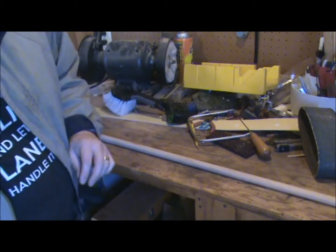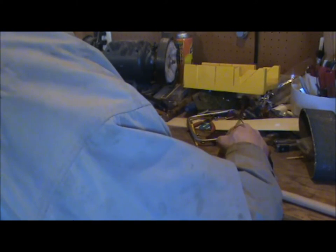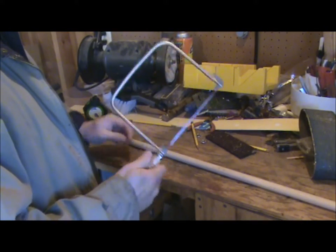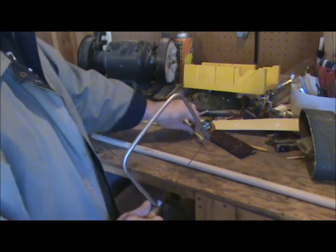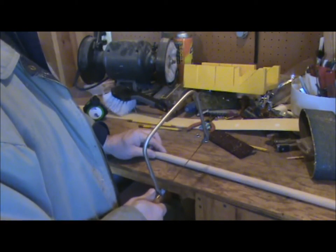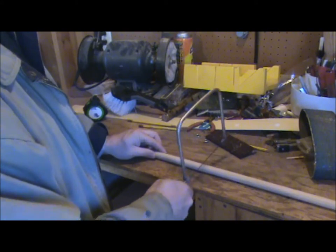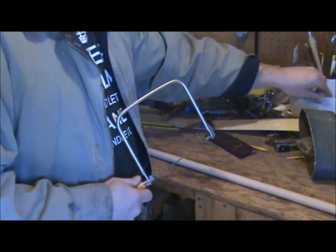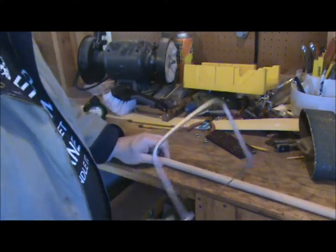I'm going to mark 16 inches and then start cutting using a coping saw. I've used jigsaws and they always split the ends, so I don't use those anymore — I switched to this and got a much better result. You work a little harder but you get a better result. When you cut, you're not just going to cut all the way through — you're going to turn it as you cut. That will ensure that you don't have any jagged ends, or they'll be greatly minimized.